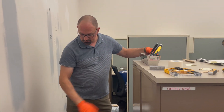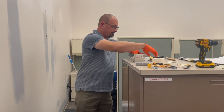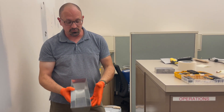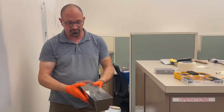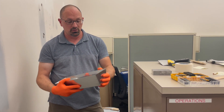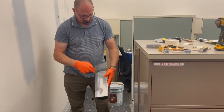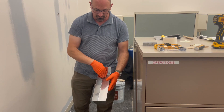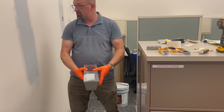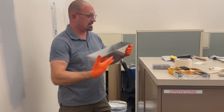I'm going to talk about basic tools for patching with drywall. In drywall, typically you'll have yourself a mud pan. Some people have a flat board that they'll use. A mud pan works good — I prefer a metal one over a plastic one. You always want to make sure that before you start, your mud pan is clean, with no residual from the last time you drywalled, because any dry pieces could mix with your mud and when you're trying to lay it flat on a wall, you're going to get bumps and things.